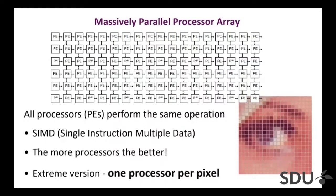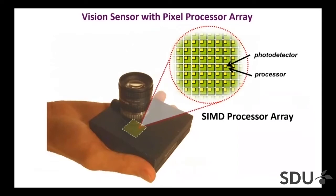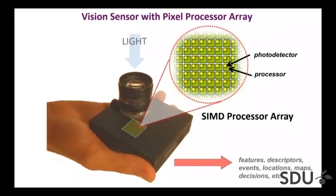We're trying not only to have a processor per pixel, but to actually put the processor inside the pixel of the image sensor. The basic premise is that we can integrate not just processing and memory, but also integrate that with the sensing in a very tight architecture. It's like an image sensor chip, but inside the chip you have photodetectors as well as processing circuitry next to the pixels. Those processors are very generic — they can do any task. The entire system takes light and turns it into whatever your things of interest are: features, descriptors, locations, events, and all sorts of other things.